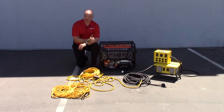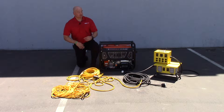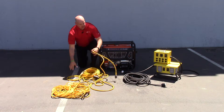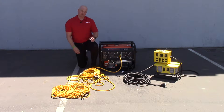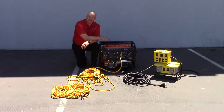Unfortunately, that's not a very typical configuration, so you're going to be hard-pressed to find an extension cord to draw power off of that particular circuit. So what most people gravitate towards is the 120 volt circuit, because it has your basic convenience outlet. You can plug in your tools or extension cords directly into this 120 volt circuit. The first issue is that you're really only utilizing about half the power of this generator — a very inefficient use of your power.